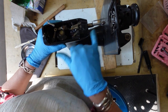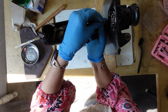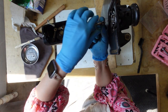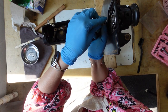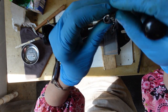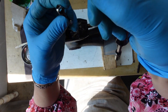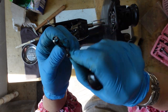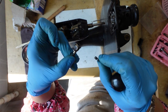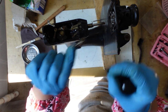Okay, let me go ahead and pull this off down here, the needle clamp. Okay, get this off. Got a little screw down there at the end, and now I can slide the rest of it off. And it has a little thread guide set inside of it that I don't want to lose. The thread guide has this little nub, I don't know if you can see, that fits inside the needle bar clamp up against the side that has the screw, like that, okay?